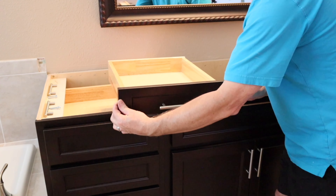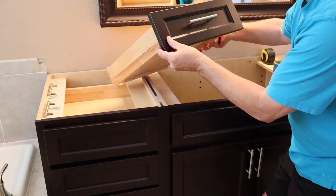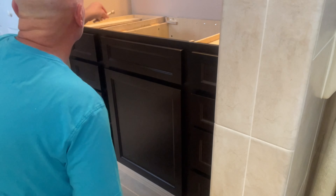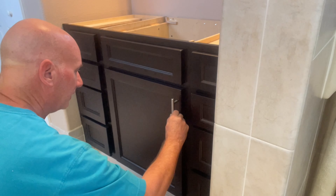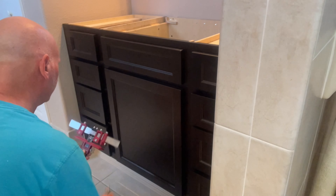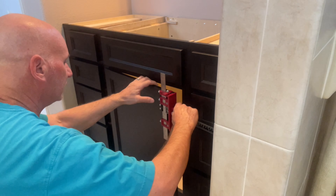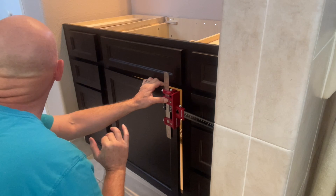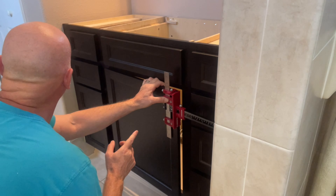With regard to putting the hardware on, I make sure I run both screws up together — I don't try to tighten one side at a time, because of the eighth-of-an-inch disparity between the centers of some of these posts. I put it together with a small Phillips head, bring the screws so they're just barely touching, then do the same on the other side while it's still a little loose. Then I tip it up and look at it to see if it's straight and level — that looks perfect. Then I add strength and really bring these home. One down, seven to go.